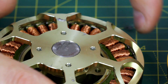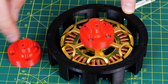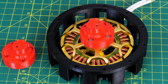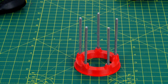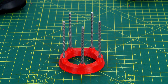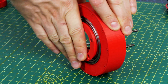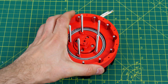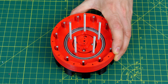So it's time to chop off the centre pin, which I did on the originals so they fit in my cycloidal drive assembly. That's because directly mounted on top of the motor is one of the offset cams, and in the bottom there's a captive nylon lock nut which eventually has an M4 bolt bolted into it. The main casing for the motor fits on top, but first of all we have to put the output on, which consists of 5 bolts bolted into a piece that fits into a bearing. This time I've used captive hex heads to stop them swivelling round when I screw onto the other end, and that fits into the main casing. That's attached with screws onto the motor housing, and now the motor and the output can turn independently because they're going to be turning in different directions at different speeds.